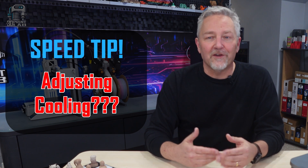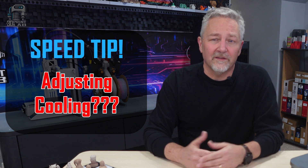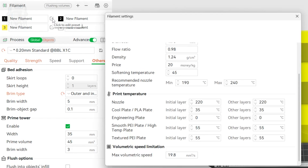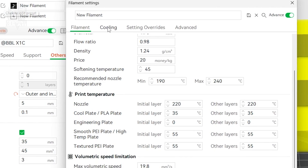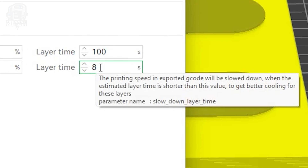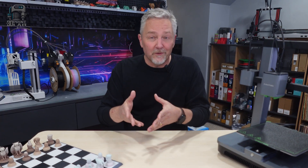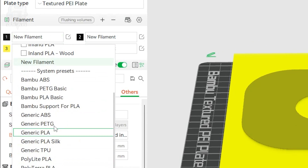Here's where after a long search and numerous comparisons, I found that one setting that needs to be adjusted, and it really makes a huge difference in print speed. And of all things, it comes down to cooling. First thing we need to do is go back to those filament settings, and then under the cooling tab, we're going to look for max fan speed threshold. Next to that fan speed, you're going to see something called layer time. That number — most likely an eight — is going to be one of the biggest wastes of time you'll have, especially on smaller prints. The generic PLA settings has this at eight seconds, meaning every single layer has to have a minimum of eight seconds before it's allowed to go on and print the next one, whether it's a full build plate or just a tiny little screw. A small layer could take a second or two to print, but then just sit there for the next six or seven seconds doing absolutely nothing. Looking at the standard fan boost setting for PLA, I found their layer time is set to four seconds, which is way more reasonable than eight.